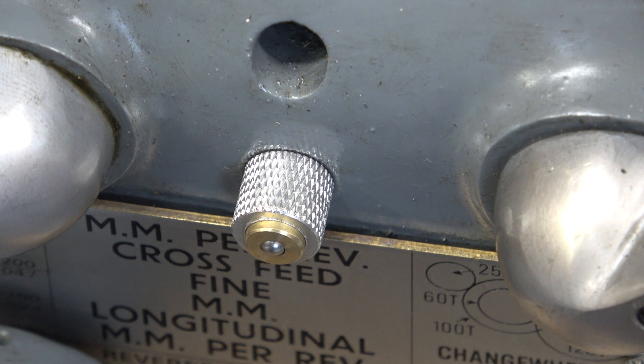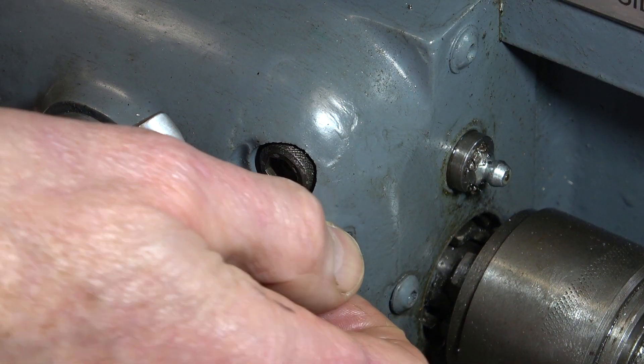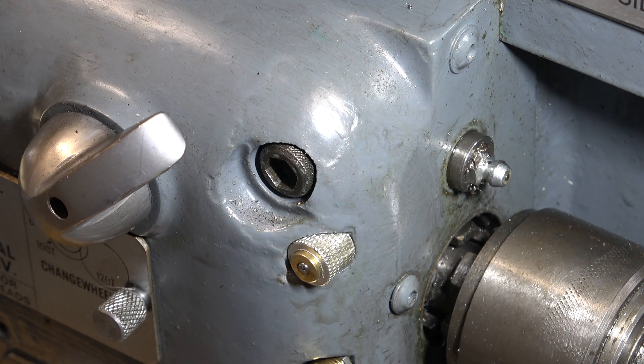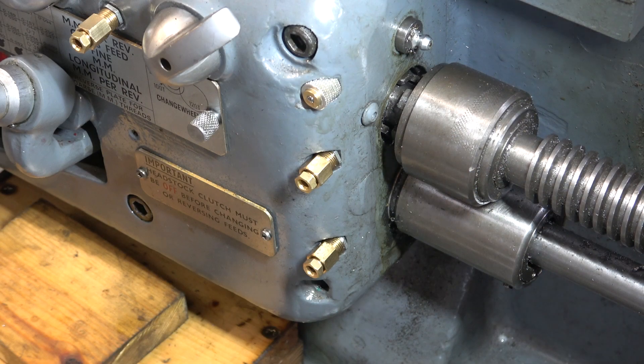That's the first oiler in place. It will also screw into this recess very easily. I've discovered through experience that it doesn't take much pressure to feed oil into these points on the gearbox. Although it had grease nipples fitted before — giving the impression that oil has to be forced in under pressure — just an oil can is fine, and the oil goes in easily. You can see the oil coming out there. As for what's going to happen to those earlier fittings — I've sent to China for a cheap gear pump and I plan to set up a pressure oil feed to my spindle bearings, but that's to come in the future.